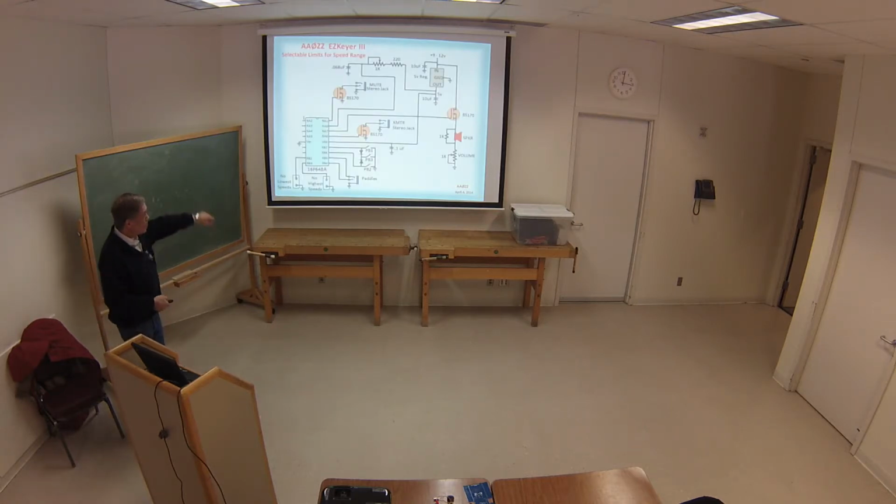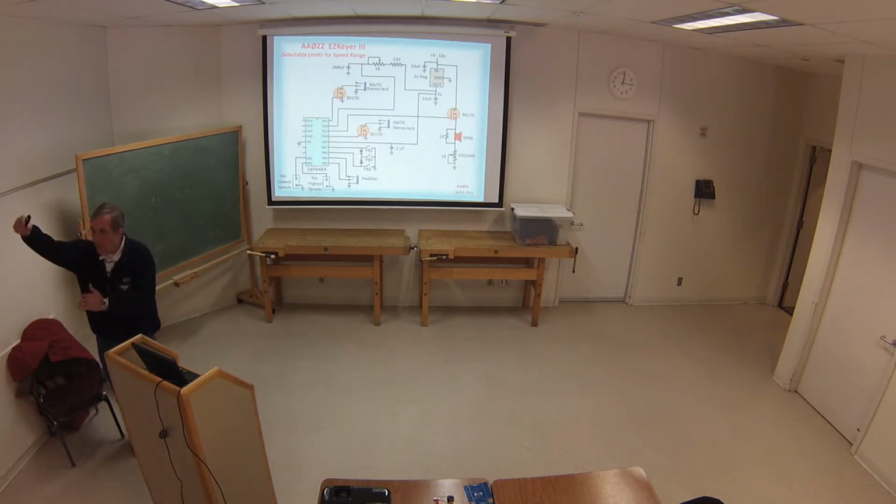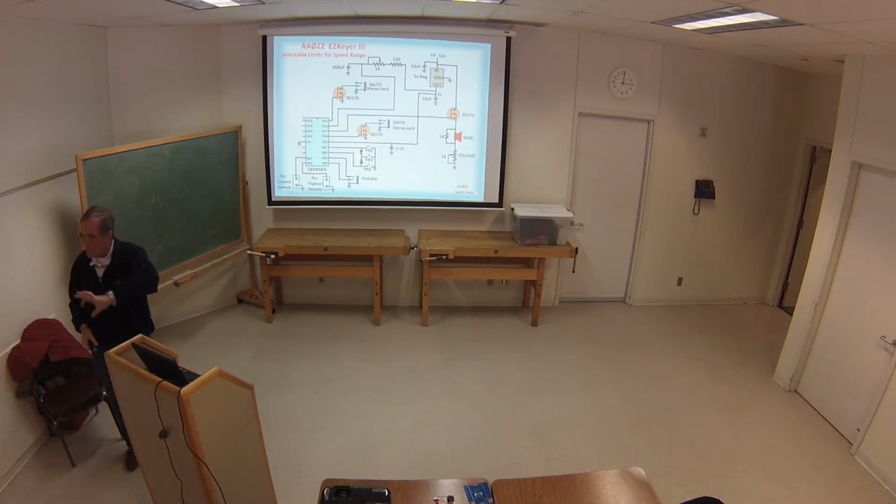So there's the 2 jumpers at the bottom here. I just hook into 2 pins, and I look for that when I run. Just checking for a digital on-off. That says if the jumper's there or not, and that says go to a different table. I have a different lookup table in the code then to see what the number of loops correspond to words per minute.